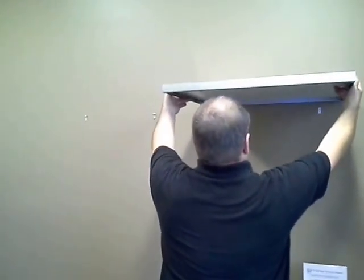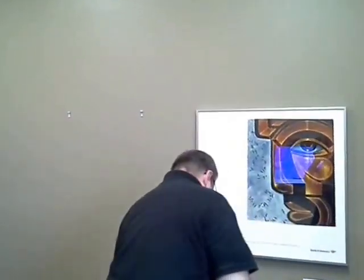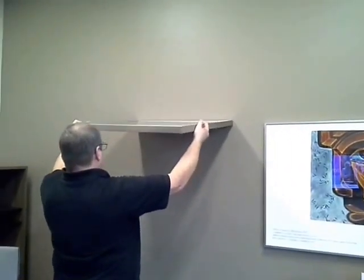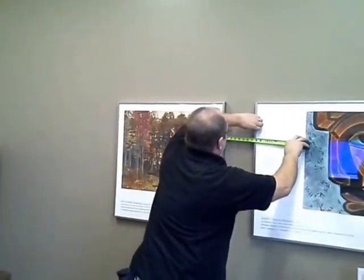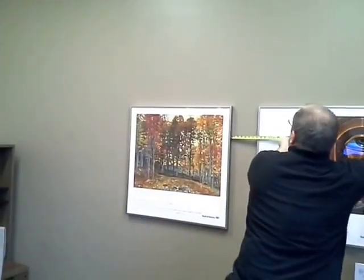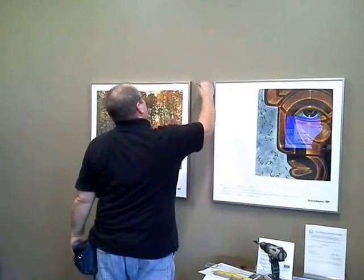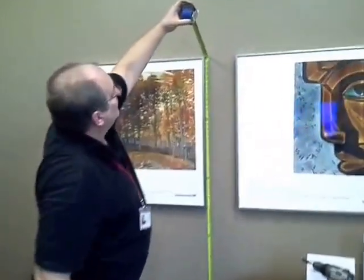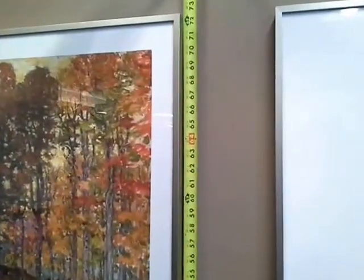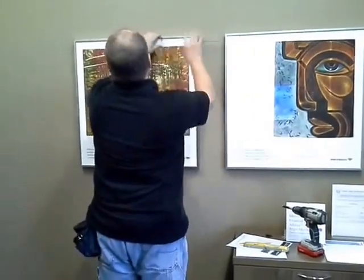Get your paintings and remember to hook them on. Four to six inches — the book says four, but anywhere in the six-inch family will be fine. Don't forget to erase your original pencil marks — you don't want to leave them on the wall. That puts you exactly at 72 inches where you're supposed to be. You can continue the sequence if you've got one or twelve, because the holes are marked at 10 inches, so it puts those cleats exactly where you want them.